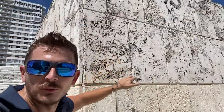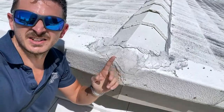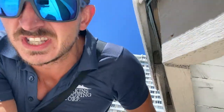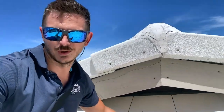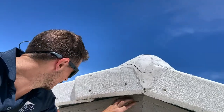Not to mention the incredibly porous tile at this detail. You can see the cracked mortar here at the wall transition — they used copper L-metal, the most expensive type you can buy. But with that copper L-metal, all they did was caulk above it. Really, the stucco should be coming back down over the metal. If you're going to pay all that money for copper or stainless metals on your roof, you should stucco back over it.